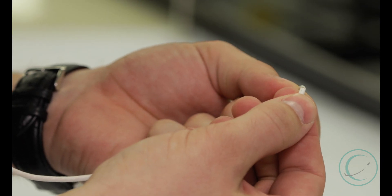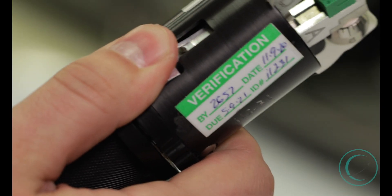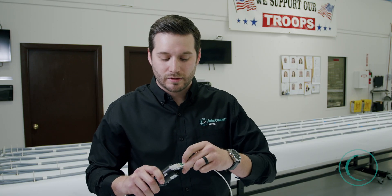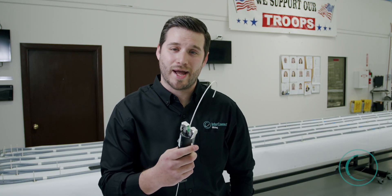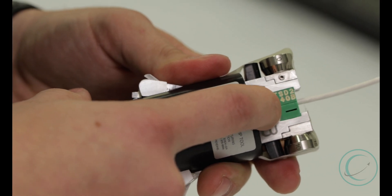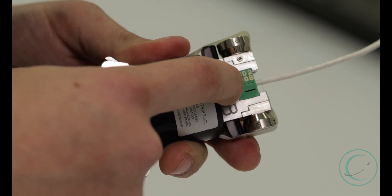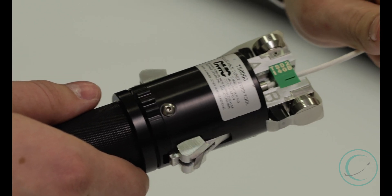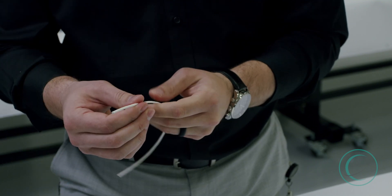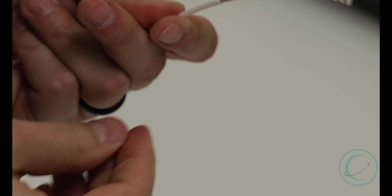That makes a clean break in the insulation, so then we can go ahead and insert it into our extraction tool. We'll start by opening the tool. This allows for enough space to slide the wire down into the cavity in order for us to extract the insulation from the wire. There's a small dot here by what we call the die — this determines the size of blade we're going to use to remove the insulation. Now for the fun part: we pull and it twists the insulation, allowing our operator to easily remove the outer insulation of this cable jacket.